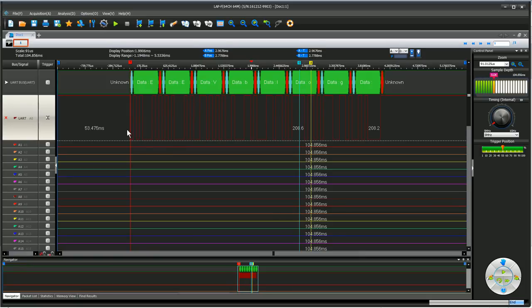That's just nuts. Anyway, I've got the 120 LV probe, which is the low voltage CMOS probe, and it's got two channels. The probe I was using before is actually the EMMC probe, so that was entirely different, designed for probing an EMMC signal. So I've now got the regular low voltage CMOS TTL type. They do have a TTL probe specifically, but you have to get the specific type, and this is a two channel, so there's 32 ports on the unit itself, and you can get up to 64 channels because each probe supports two depending on what you're probing. So there you go, I resampled it and now we don't get any of the crazy data, so that's just fine. So yep, sorry about that.